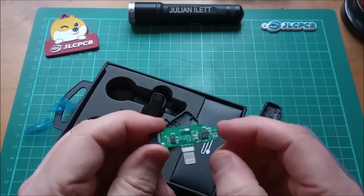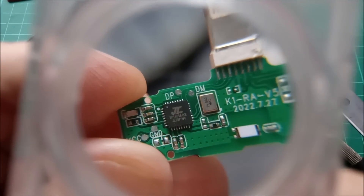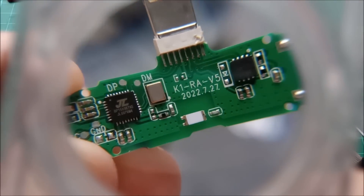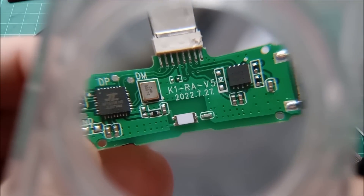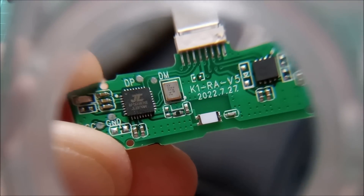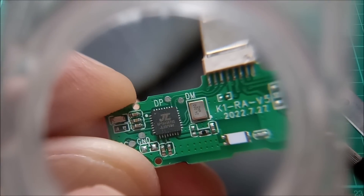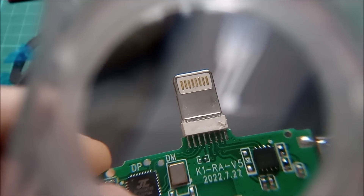There are a couple of chips on here — there should be some RF kind of stuff so let's have a closer look. Here's the receiver and we've got a main chip there. It looks like BP156-something, and it has a crystal — 24 megahertz. The little white square item at the bottom I'm pretty sure is some sort of antenna, because there's a capacitor to ground on the right of it. There are two inputs to the left, although one is tied to a large copper area which might also be ground. The signal comes in through this network of resistors and capacitors and goes to that antenna.